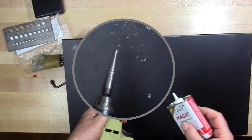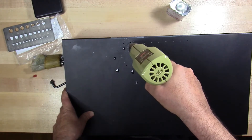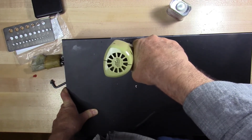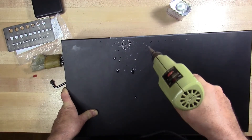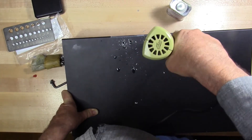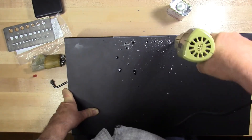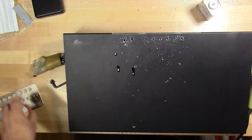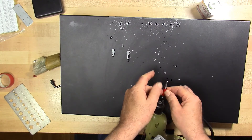We'll apply that — this has to be well lubricated. I'm not drilling for a specific size at this point; I'm just making the holes progressively larger, sneaking up on the final hole size a little bit at a time. I haven't drilled out the hole for the chassis ground because that needs to be drilled separately and a little more precisely. The larger holes just need to be large enough so the center contact of the binding post never comes in contact with the enclosure panel.